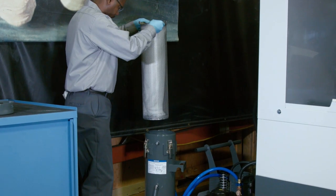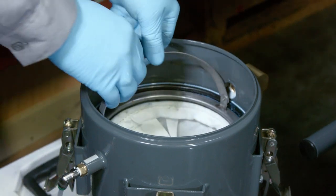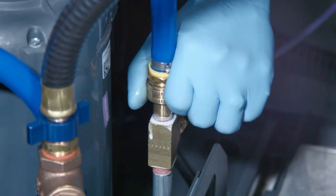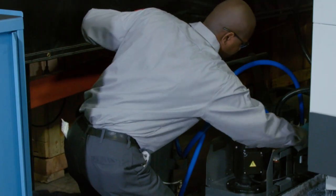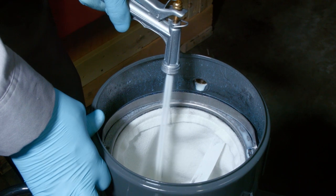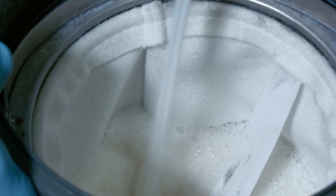With the bag in place, Orville places the metal strainer and the filter bag back into the tank. Orville reconnects the supply line to the coolant pump and wipes away any spilled coolant. Orville will use the wash-down hose to refill the ACF tank, so you need to power up the machine before reinstalling the lid.